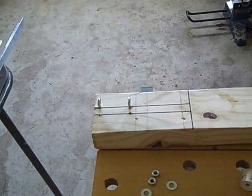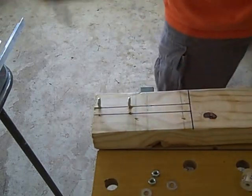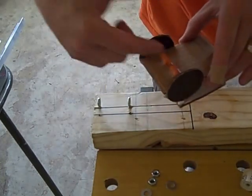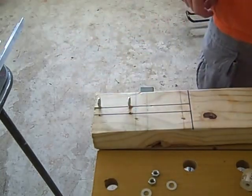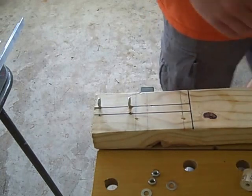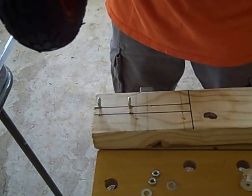Another video intended to help me get some feedback and design advice on the mobile robot platform. In this video we're going to talk about how I intend to attach the wheels to the robot body and couple with the motors. This is the toughest part for me. I decided that using belts or a gear-driven system would be too difficult, so I want to directly couple the motor with the axle shaft on the wheel.